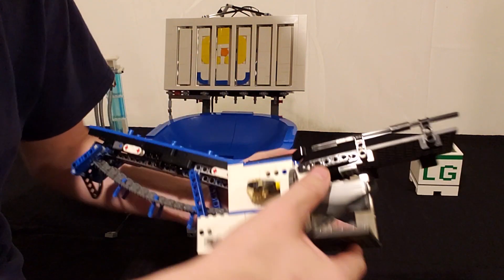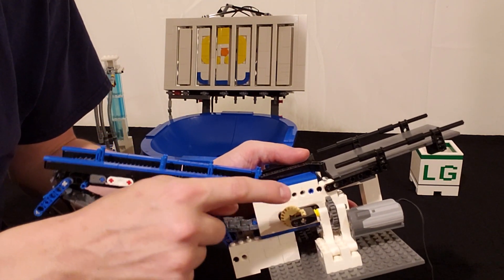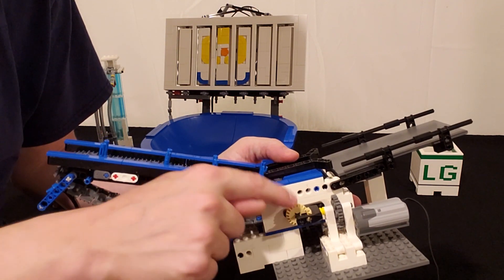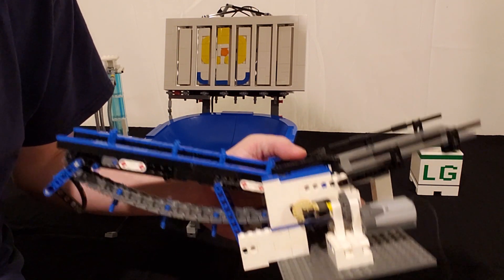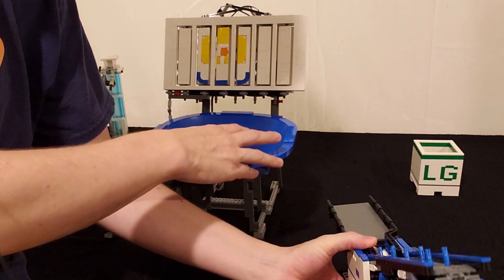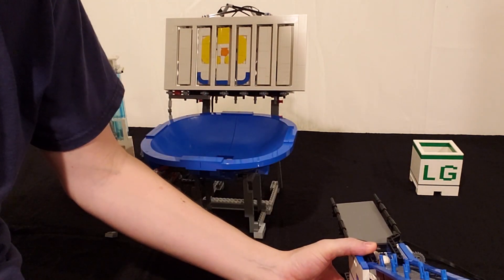The last thing I always do to these modules is swap them out to use a modern bevel gear set. One of the advantages of bevel gears is if you plug it in and it is running the wrong direction, you can just flip that to the other side. So that's the output, and its whole job is just to clear this mechanism so that the next module is not hidden behind it.